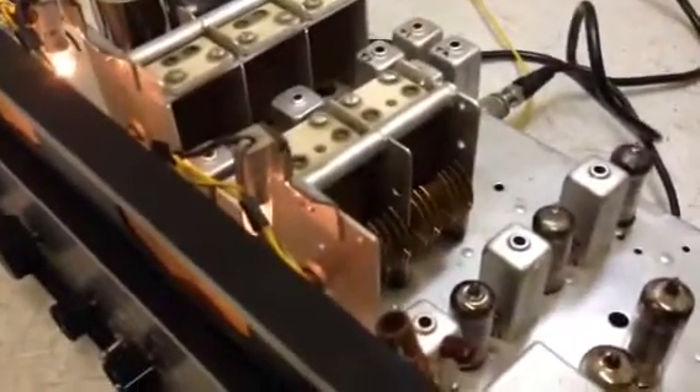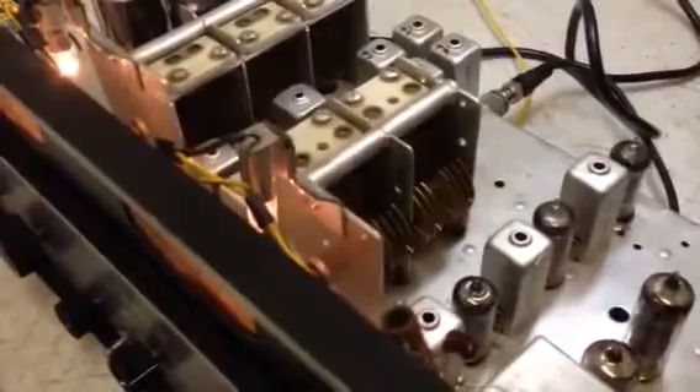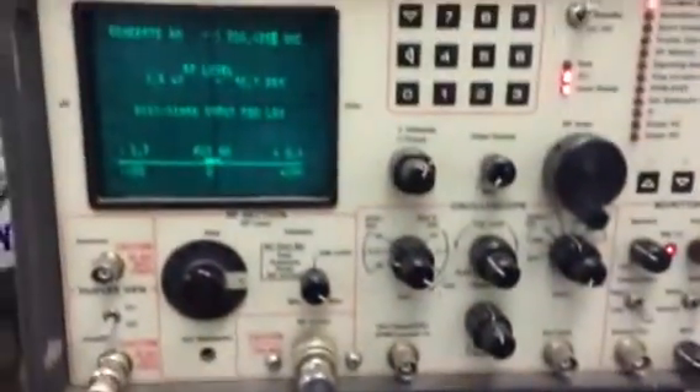This is really straightforward — we could use a voltmeter as indicated in the instructions, but in this kind of receiver the S-meter looks great. Watch the S-meter — I'm going to hit the first IF, second IF, third IF. That's it. I told you it was simple.